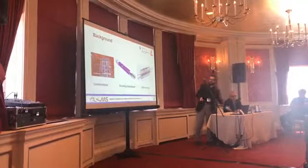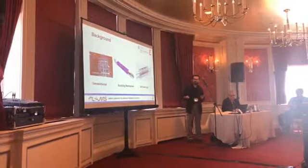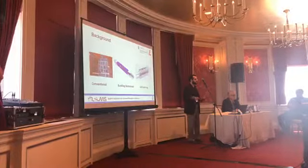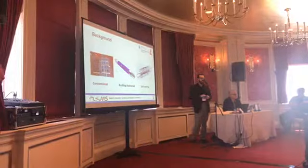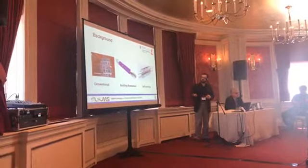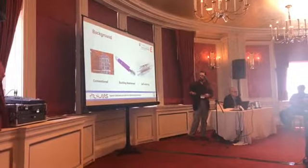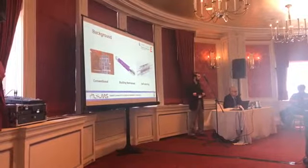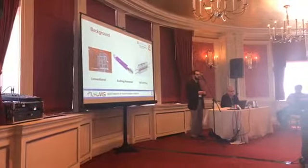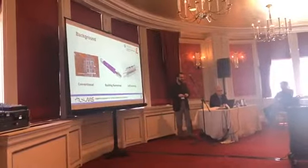So typically there are, again, three types of bracings. The oldest kind of bracing is the conventional or typical bracing, mainly composed of typical HSS sections or some steel components. The other type, which is more recent, is the buckling restraint brace. And then the very recent type of bracing that started emerging into the research and industry is the self-centering bracing.